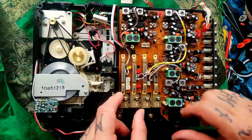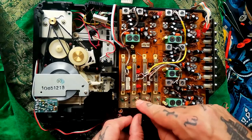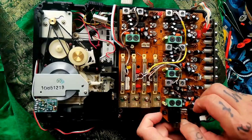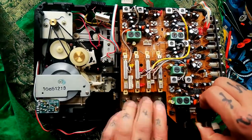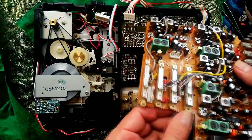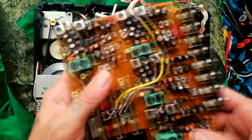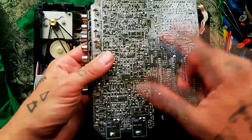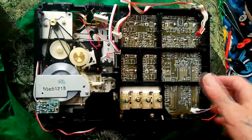With those cables out of the way, these switches connect to these plastic tabs here. A bit of a wiggle, then I'll tip up like that. Say a bit of a wiggle, these need to be pulled back or they catch on this lip here and it doesn't come out. That would give you access to any soldering or anything you needed to do back there.